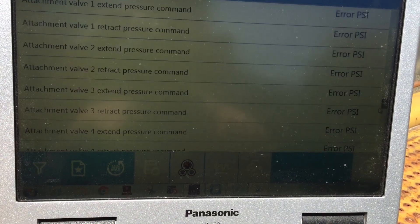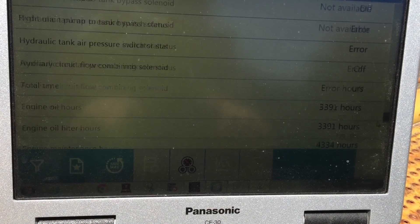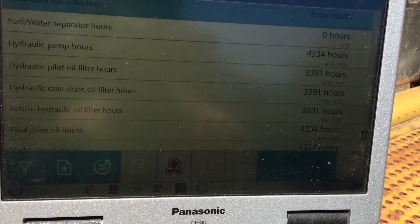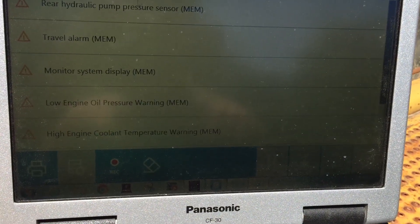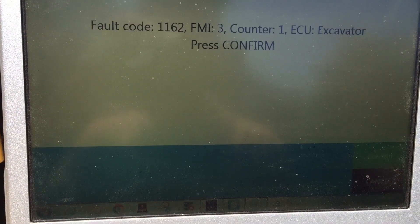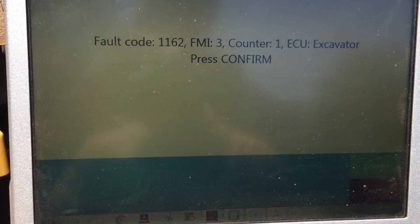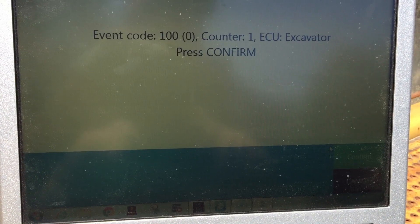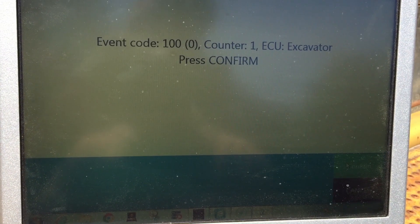Your status is involved, main flow pump, engine hours, things of that nature. But here under your faults, as you can see this one's got a bunch of inactive codes in it right now. But if you actually double-click it you'll get your fault code and your FMI there — that way you've got something to look for. Double-click that. Event code 100.